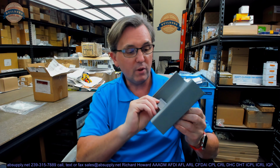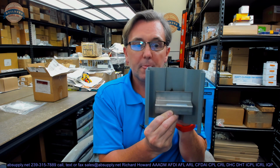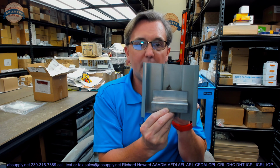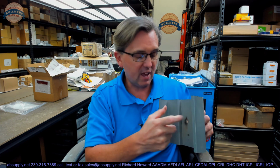But first, the FR290 is supposed to look like this. You're going to weld that into the frame, right about where that weld mark is. You're going to weld that to the frame on the backside of each rabbet. You're going to want to be careful not to throw too much heat into it, because then you're going to have this, and you're going to have to dress that. And you don't want to see any of that if you can help it, because you will have to sand it, you will have to prime it. Depending on the abrasive you're using, you might leave some score marks. So you're going to want to get that welded in there, welded to the point where it's not going to come off. That can't ever come off.